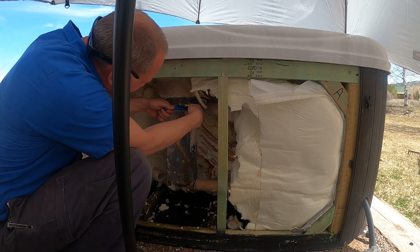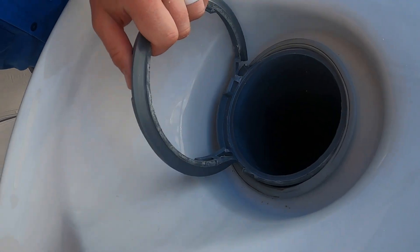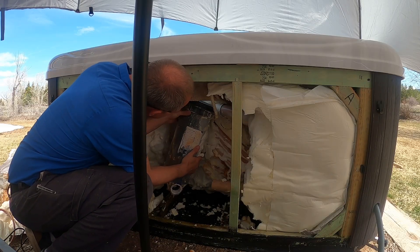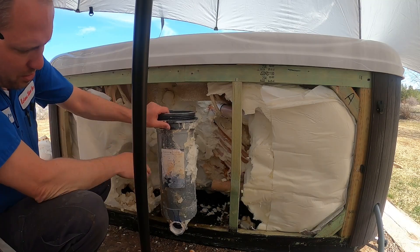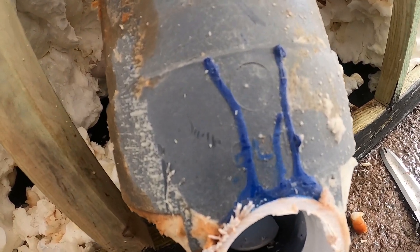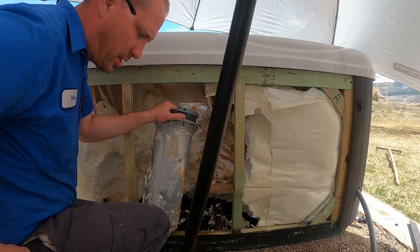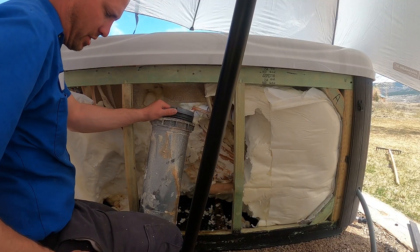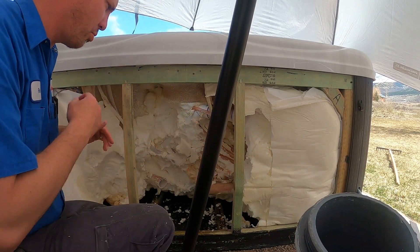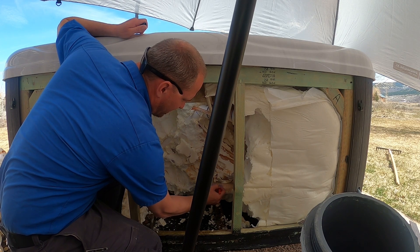It's not super tight. Instead of pulling it straight up out, you could drop it down in. So when you pull your filter bucket out, these should be labeled — that side is labeled 'out' and this side should be labeled 'in.' It's hard to see on the camera, but you want to pay attention to the out and in, which direction the water's going, because you want to put your new filter bucket back in the same way. This side was the out way, so water's moving in this direction.